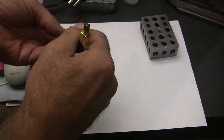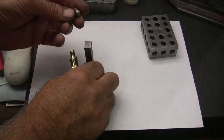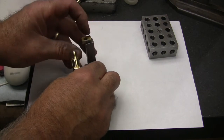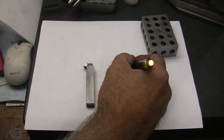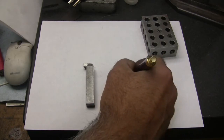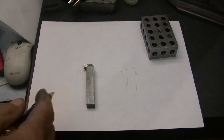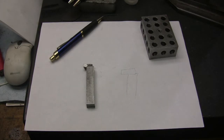I'm going to have to deburr that so it'll set up. I want to set it up like that and put the silver solder — put this carbide right on the end of it, just like that. So it'll look like a piece of carbide on the end, and then my piece fits in my tool holder.